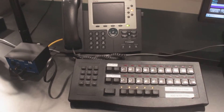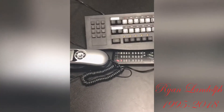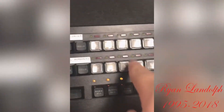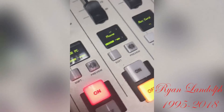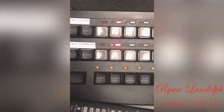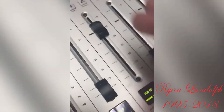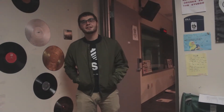The phone in the studio may seem confusing but there's really not much to it. If you're expecting a call and your caller is calling and you know who it is — when you see it light up, just click Call On Air, the top button. Come over to the board, take your phone, turn the fader all the way up, and click right here and they will go right on air. Now if you don't know who's calling, hit the bottom button for call screening. You can pick up the phone here, talk to them, then hit the Call On Air button again to verify who they are before you go on air. Turn your phone on, make sure your fader's up — that's it!